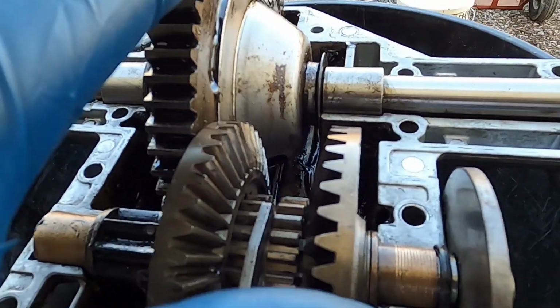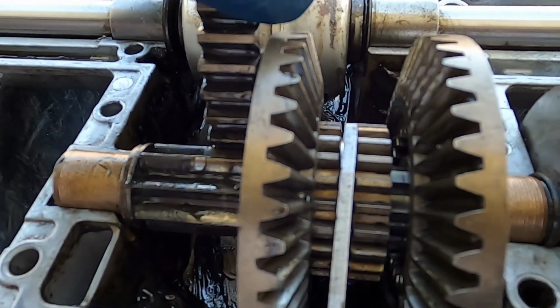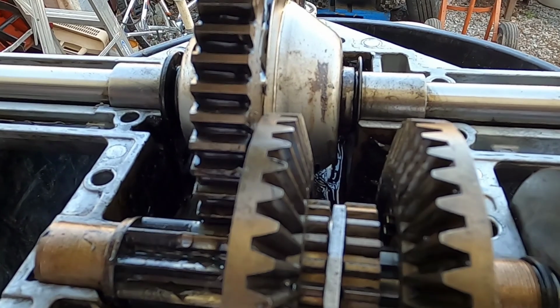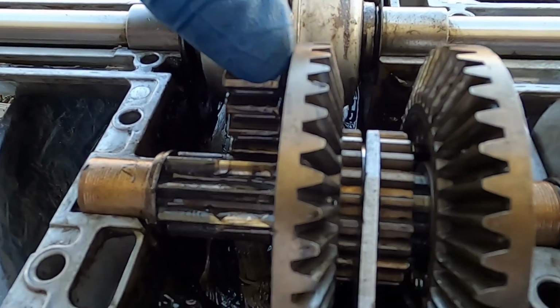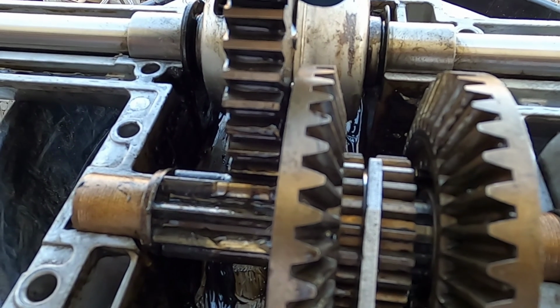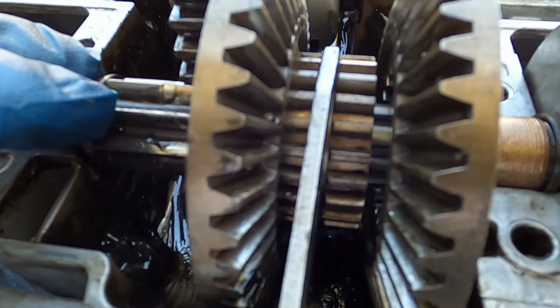And this transmission doesn't affect the speed. The speed gets adjusted by the pulley that's under the tractor. That's a whole different setup altogether. On the hydraulic transmissions, it affects the speed. On this particular transmission, it doesn't. So I think I covered all the bases on this.